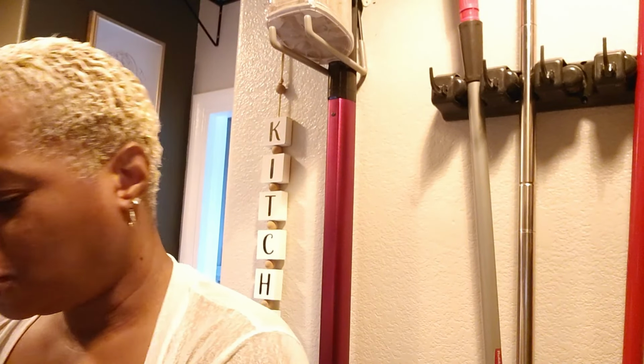These are the new boxes that I am using right here. So you knock this back and you feed your wires through there. And then these have screws in them and flaps. So these flaps go into the drywall. Once you have the box in there, you screw this down and this pops up, and this is what keeps it from coming out. But I also leave enough drywall so that I can secure this one and this one, just because.